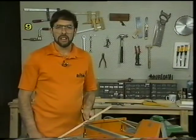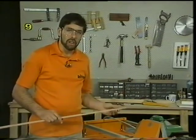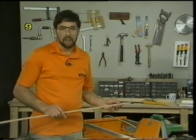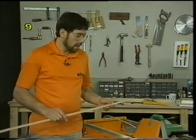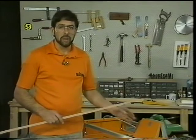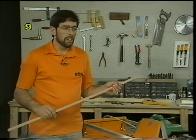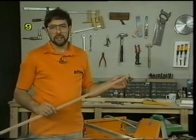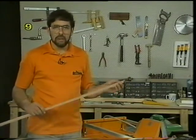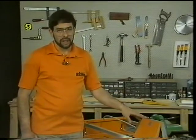In a climb cut, the saw blade is cutting down onto the work and holding the work firmly against the table, rather than a feed cut where there is some tendency for the work to lift off the table. You can use that to good advantage when cutting thin flimsy pieces of moulding, quad, or picture frame material — use the blade to hold the work down on the table. Of course you can always cut those pieces in table saw mode, but if they're very long and awkward and you happen to be in cross cut mode, you can do it as a climb cut.